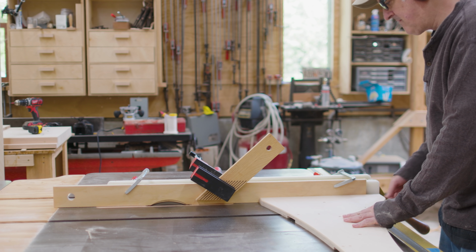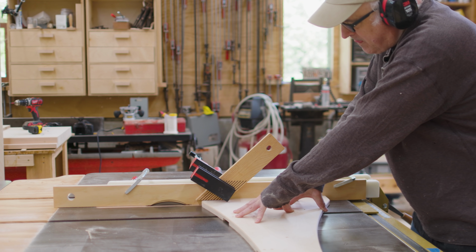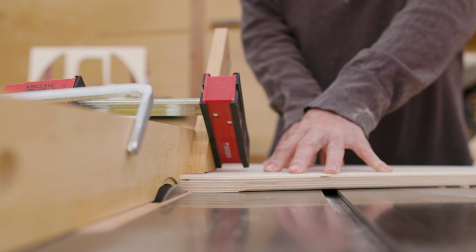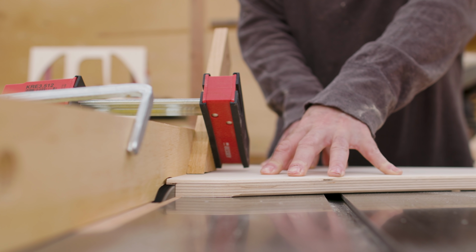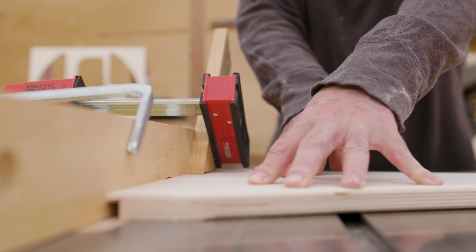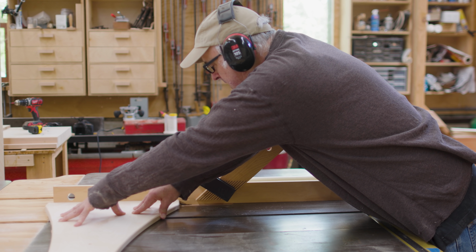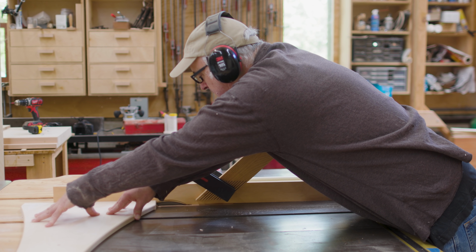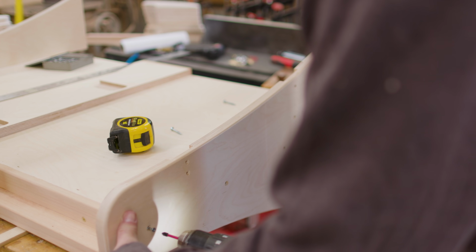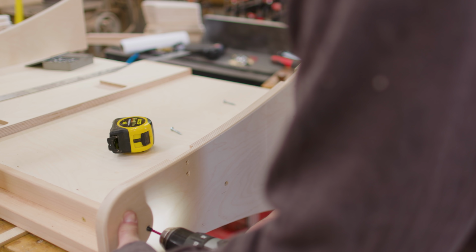I took the side panels off. You can see how the screws are important now. Because I realized I didn't want the back panel to show on the ends. So I cut a rabbet in the edge of the side panels so the back panel would be hidden. Because I'd attached it with screws, I can put it back in exactly the same place now.